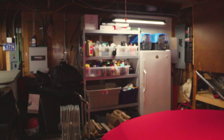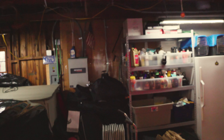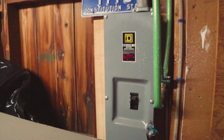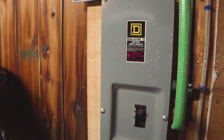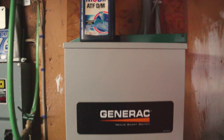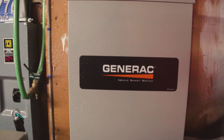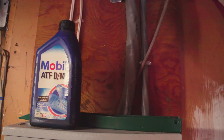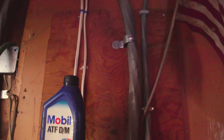This house is actually kind of interesting because while they have an old defective panel, they have all new equipment other than that. This is the new main shutoff manufactured by Square D — that's modern, that's good, that's all fine. It takes the main power through a thick wire and puts it into this box here, which is a switcher for a generator. When power is not coming through the main service from that thick wire, it is actually coming through from a thin wire coming from the generator, which goes outside to where the generator is.